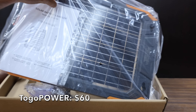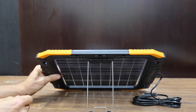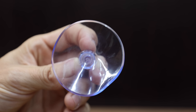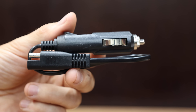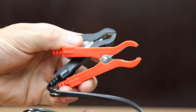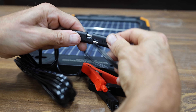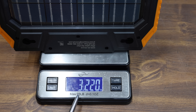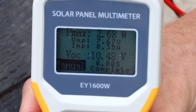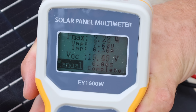At $60 is the Toga Power — a 12-volt battery charger and maintainer with built-in MPPT. It's claimed IP67 waterproof and able to track max power point to increase charging efficiency by up to 30%. It automatically adjusts voltage during trickle charging without overcharging. Made in China at 1,462 grams or 3.22 pounds. Unfortunately, the Toga Power seems underpowered at around 2.68 watts and 10 volts flat — not enough to charge a car battery — and only 2.28 watts at 28 degrees.